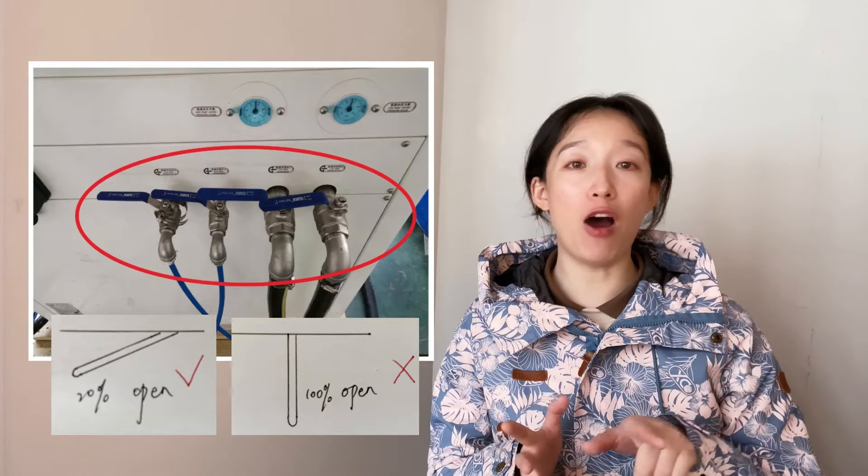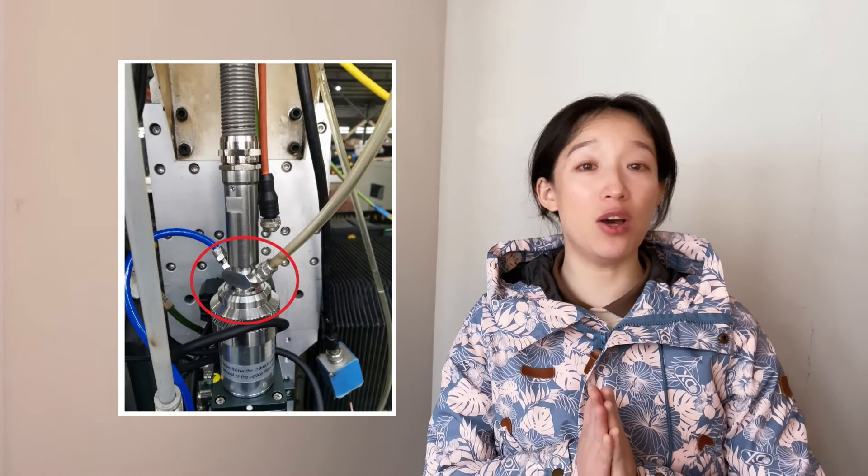If the above checks are good, we can add pure water into the water cooler and let it run idle for 30 minutes to check if there is any water leakage. If the temperature is lower than 5 Celsius, antifreeze needs to be added according to the correct method. After 30 minutes and no leakage, turn on the power of the water cooler and keep other equipment powered off. Open the water inlet and outlet valves of the chiller a little, rather than opening the valve completely. After the water cycle starts, take no actions for 30 minutes, observe whether the water level changes, and make sure there is no leakage in the internal water pipes. If there is no problem, the water cooler can operate normally — wait for the water temperature to reach the specified range.